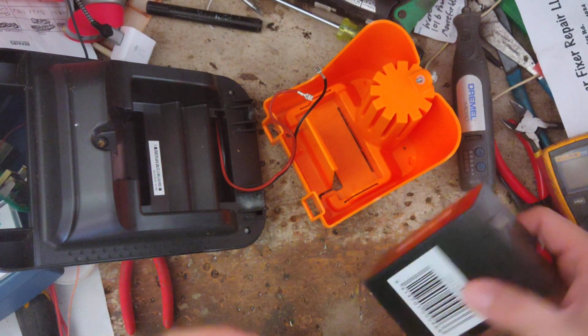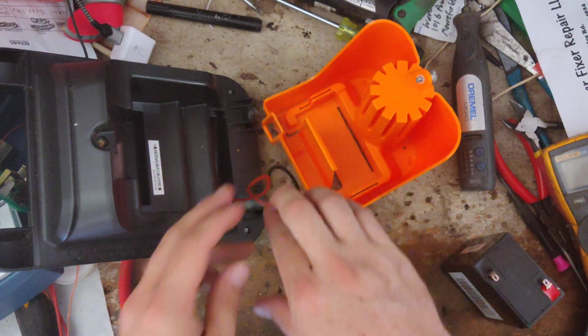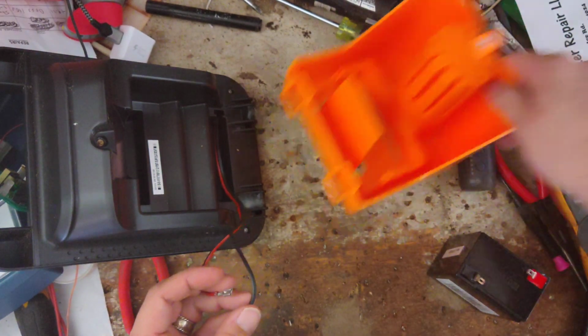But if your battery is over 6 and it's only flashing red every so often, go ahead and unhook it from the fence and ground and turn it back on. If the light still shows red, and you check your battery and it reads good, one thing you can try to do is a reset.